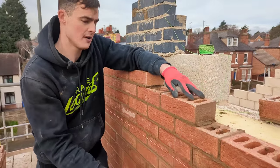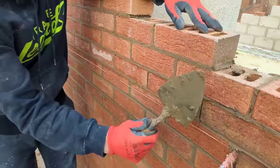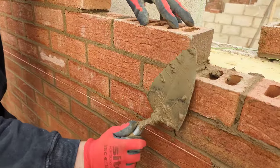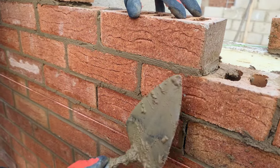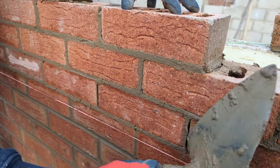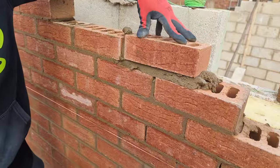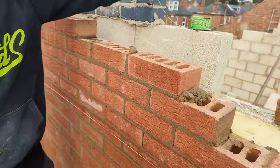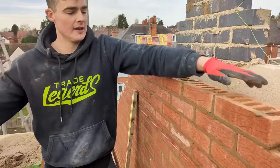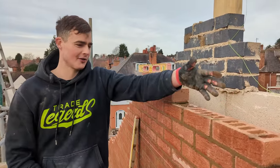But you're just wasting so much time, and also you're kind of smearing the brick, okay? So when you scrape a decent angle, you don't want your trowel, let me clean up the trowel, you don't want your trowel like flat against like that, okay? Because I'm going to do an example, you can see it's slowly smearing, okay? 1, 2, done, forget about it. 1, 2, that's laid, that's done, okay? No need for excessive scraping, okay? Although I just did 3.